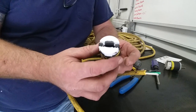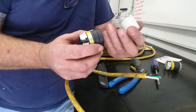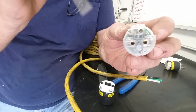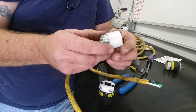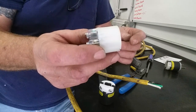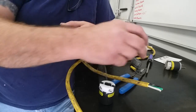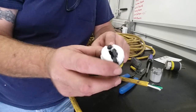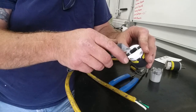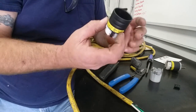On the back side of your plug you need to pull the body out — it's right here. From inside you can see the green circuit board in there. These things are surprisingly robust because extension cords get dropped a lot, but I've seen these take some pretty good hits and the electronics inside survive unless the outer case gets physically damaged. Here's your backside — it's got a built-in strain relief, and there's a little removable piece in there. If you're running a very small gauge cord you need to leave that piece in, otherwise pull it out for your larger cords.